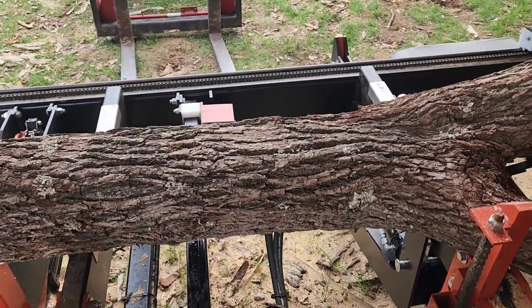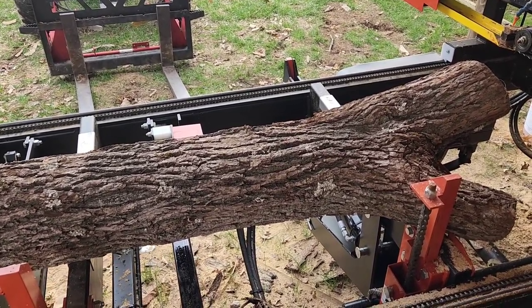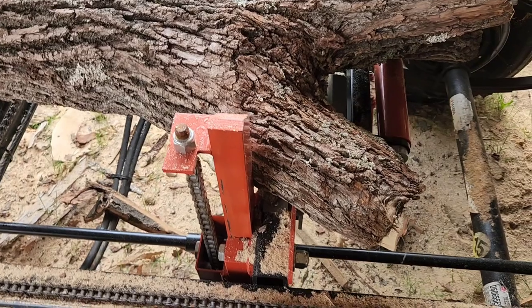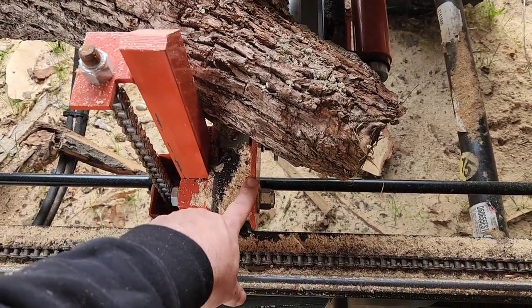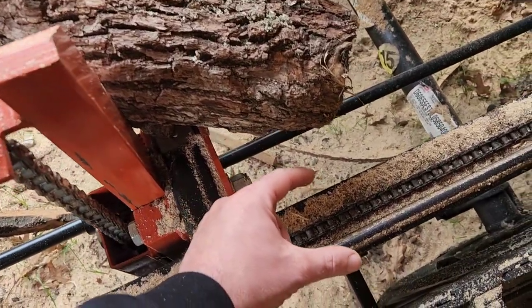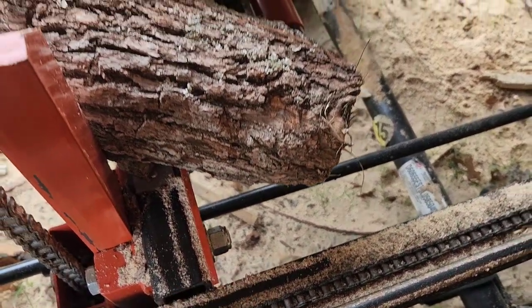That's going to give you the figure I look for. If I'm going to cut this log, it's going to be a non-typical way of cutting it — not just throw it on the mill and slab it up like a normal stick of pine. I'm limited on this sawmill by my carriage, which travels only to about that line there and doesn't go to the full width of the frame. So if any of this log extends over that line, the carriage will not pass.